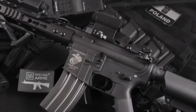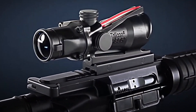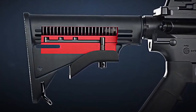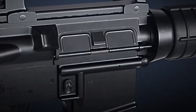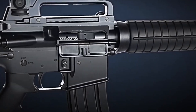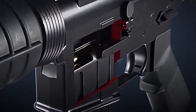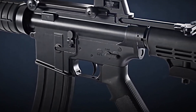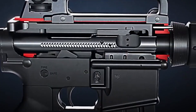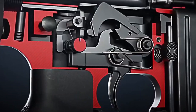As the parts come together, the rifle starts to take shape. The upper receiver, milled from lightweight aluminum, houses the completed barrel, the gas system, and the bolt carrier group. The lower receiver holds the trigger, magazine release, and buffer system. When these two halves lock together, you get the AR-15's familiar silhouette. Each step is checked and double-checked, because a single missed detail could cause headaches later on. At the QC station, team leader Jim Ross ensures none of these precise pieces slip through flawed.